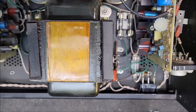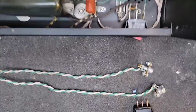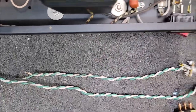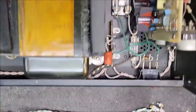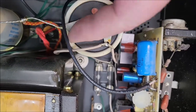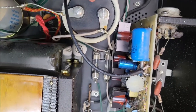Now, the other thing I do with these is a signal mod. Originally they used really cheap RCA jacks and then just twisted pair wire. So I make a 9-inch and a 14-inch using the RG174 shielded cable. I make 9-inch and 14-inch runs.